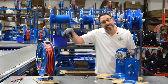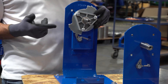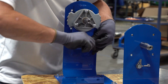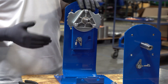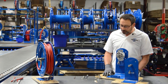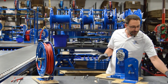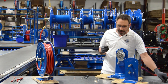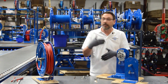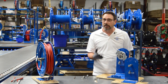Here's how the actual mechanism works inside the reel in the back. As you're pulling your hose out it makes the ratchet sound that you hear, and then it stops and locks it in place. Now if this spring breaks, there's nothing to stop the reel from rewinding, so the reel just continues to rewind. When this happens all we have to do is replace this little spring and you're back up and running. The easiest method avoids using hemostats or needle nose pliers to stretch the spring, because there's a chance you can damage the spring which would lead to another failure down the road.